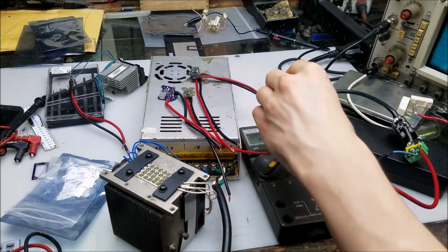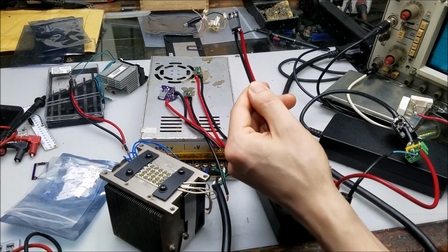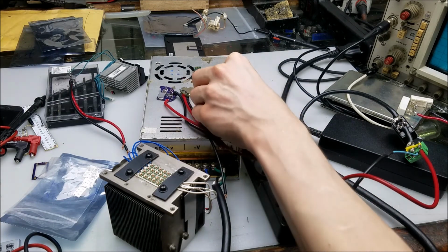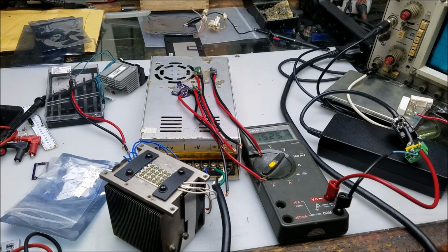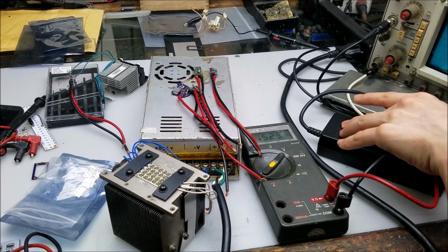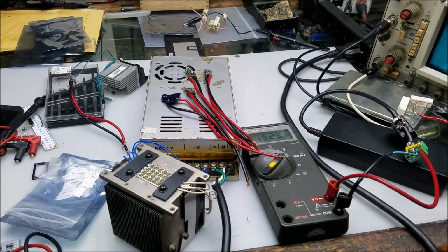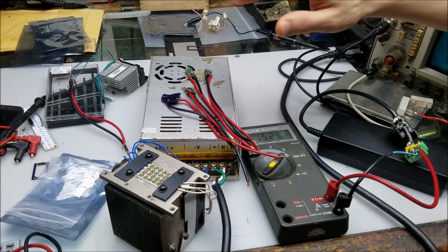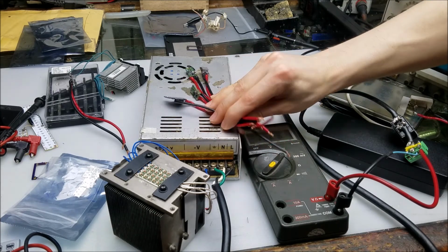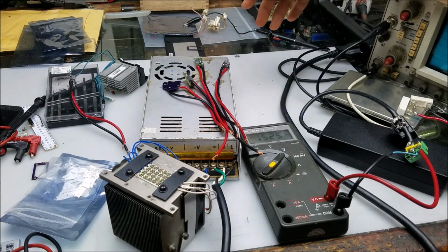So the only thing that I can think of is, because these all have inductors, and inductors can cause spikes, maybe there was some freak accident, interference or an inductive spike, when all of them are connected together that caused some sort of interference, and made the power supply either kick up past 16 volts or injected a spike into the drivers somehow. But it's not necessarily a good thing to connect multiple DC to DC converters on the same voltage rail, especially without any sort of input filtering or output filtering for that matter in this case. So a little bit of a strange error condition.